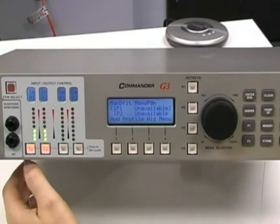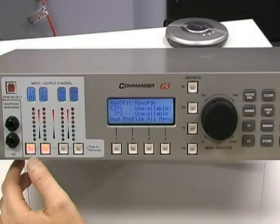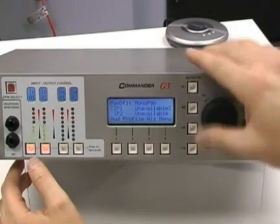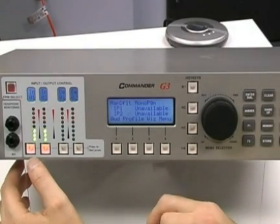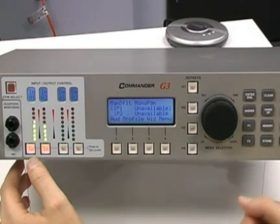Next, we need to set up a static public IP address, because this is the address to which everybody from the field will be connecting into this unit. At this point, you have three numbers from either your ISP or from your IT professional: the static IP address, the subnet mask, and the default gateway.